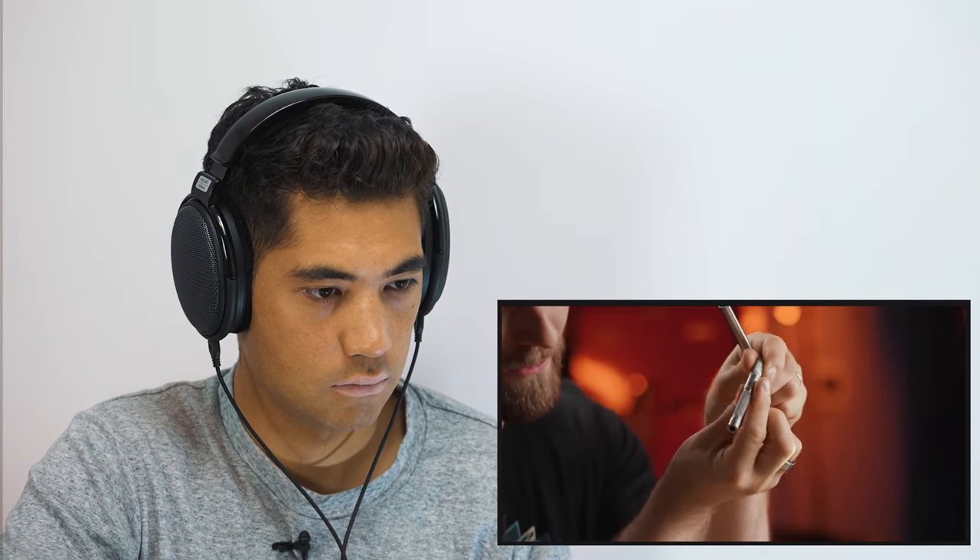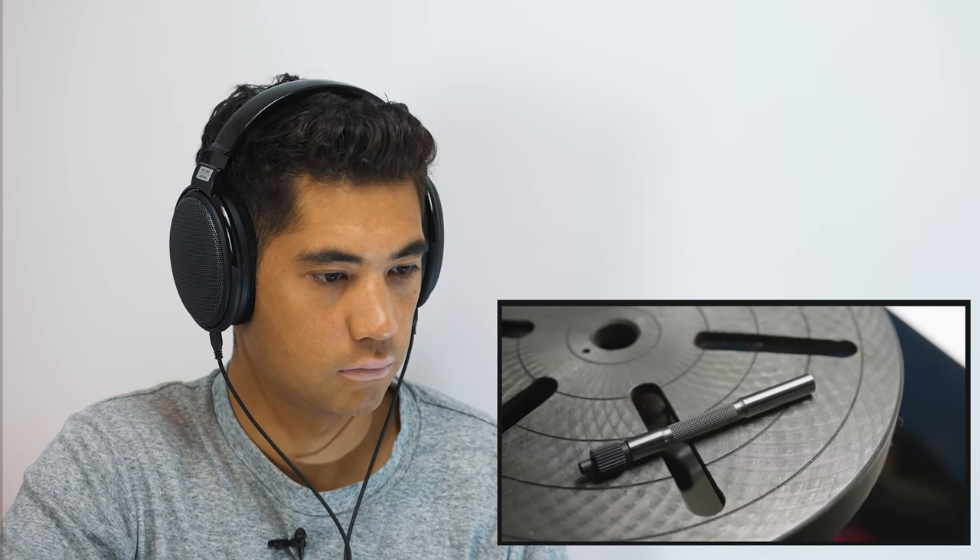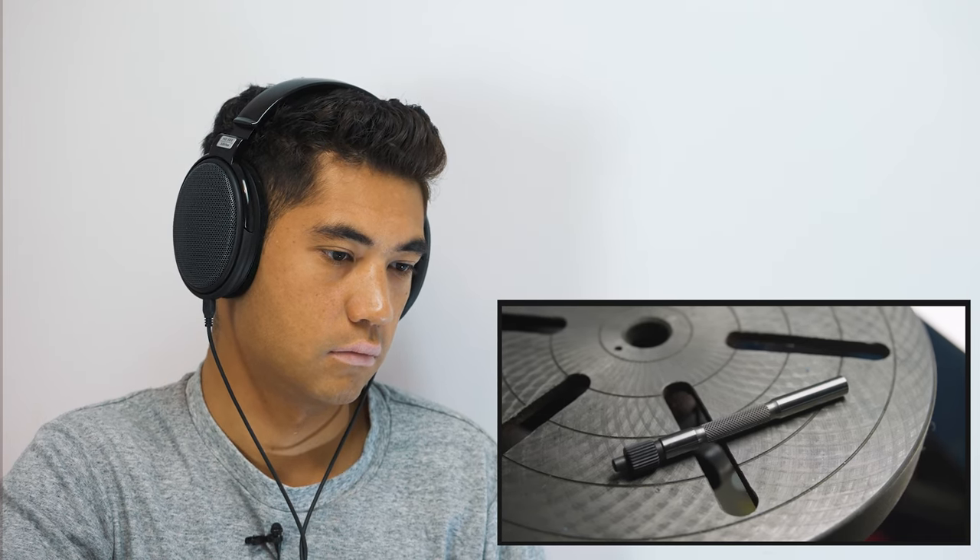While the plastic molds were being made, they also had to finalize the shaft. The original designs had knurling going all the way up to the base, but they added a ridge so there'd be as much material as possible to hold the shaft onto the ratchet. They tried a lot of different materials — aluminum (too soft and cheap-feeling), stainless steel, high carbon steel, and different knurling patterns. Straight knurling was awful for slipping between fingers.